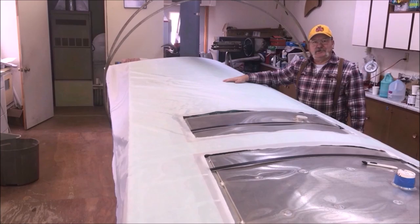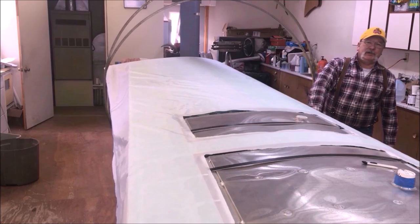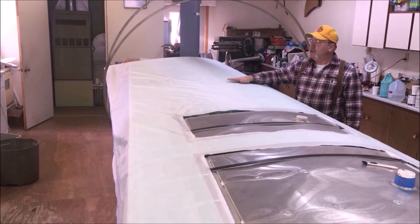One advantage of the Stewart system is our glue is thermal softening, so you can take out a wrinkle at 250, 275, up to 325 degrees, not a problem. I have set it up with an overlap on the front. If you're wanting to, you can butt your top and bottom, double cover, put a leading edge tape over it. It's up to you. Basically, I've got one huge surface tape that I'm putting down, and I'm going to put it down just like I do a surface tape.